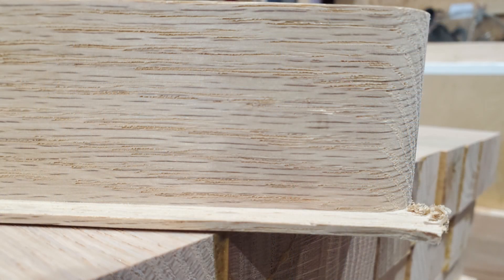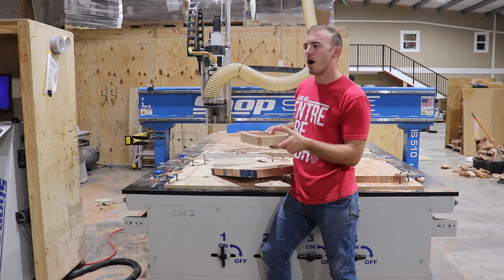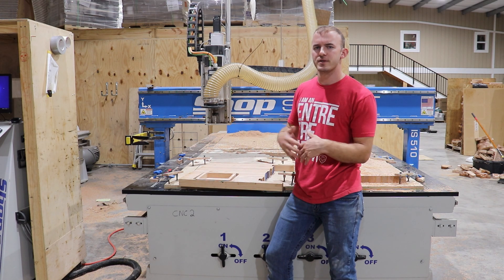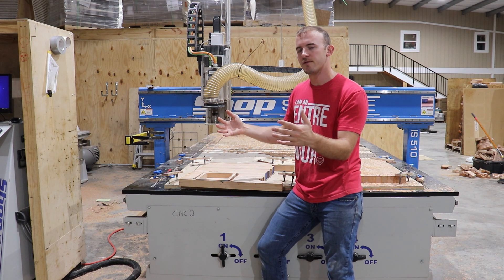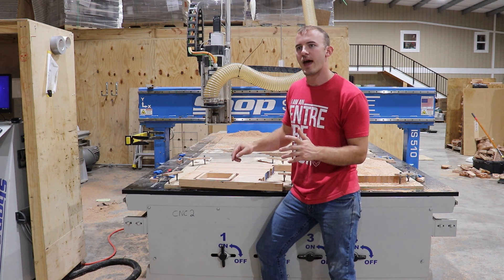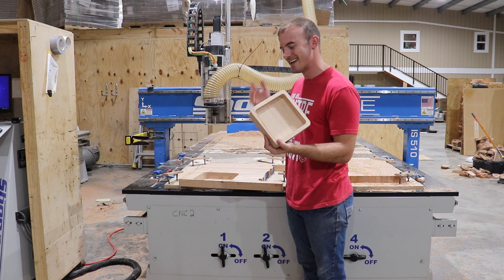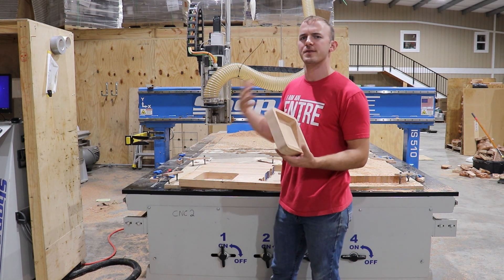The reason I leave an onion skin is so this thing doesn't move on me. I'm cutting out one — not a big deal — but one, I don't want to hurt my beautiful vacuum table. And two, I can just take it to a nice little flush trim bit and cut it out, and it's beautiful and I don't have to worry about it moving. So to recap: pocketed it out, had 92% step over, did a raster with roughers, followed it up with a finisher going a little bit deeper and cleaning up that edge with the offset I left. Then having my profile bits come — used that very same rougher I used to pocket it out with for the first pass. Then I had my other rougher come, which was an up cut, ejecting those chips out of there for the second pass in the profile. Then the finisher came and made this nice clean edge. I know this is not very practical for just one piece, but I wanted to show y'all how it is when I'm running a machine like this and how much different it is than a hobby CNC.